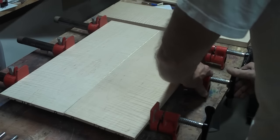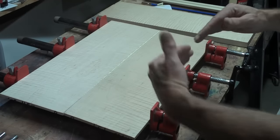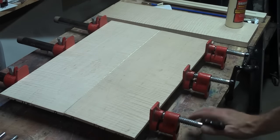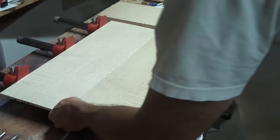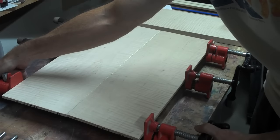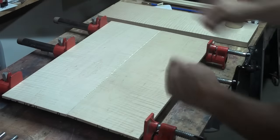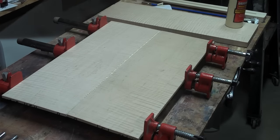to close the gap. Now, the one thing you don't want to do is put too much clamping pressure on here, because you can bow the wood, and it really isn't necessary. I see a lot of guys coming up with these fancy jigs that they create to glue stuff together, and while I'm not against jigs necessarily, it really isn't that necessary. You just need moderate clamping pressure, and I'll let that sit for a couple of hours and let it dry,